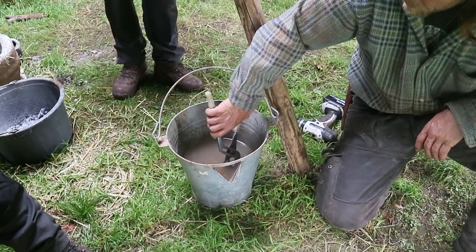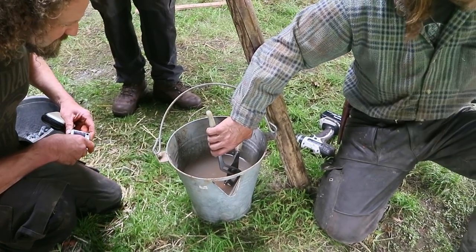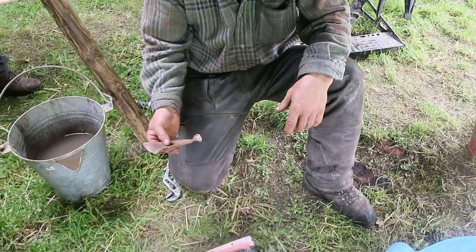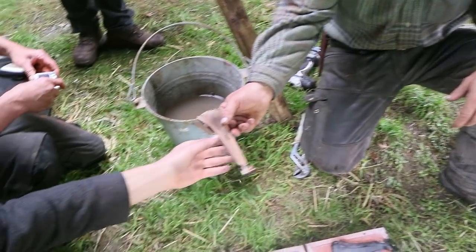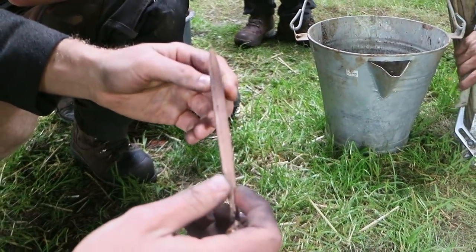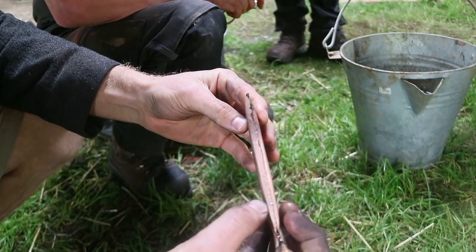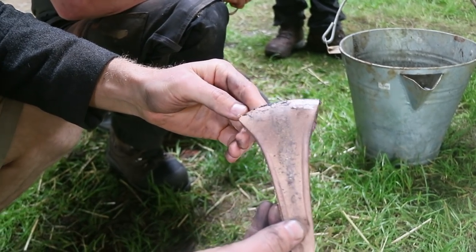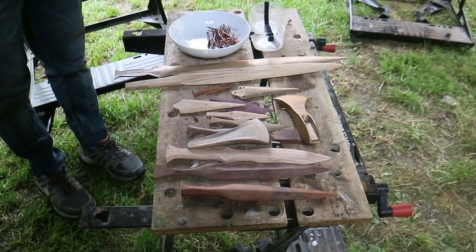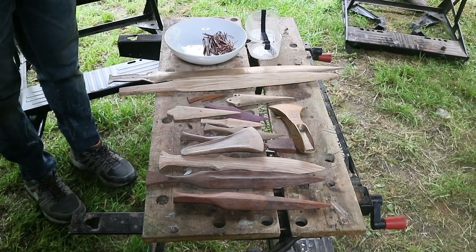Just enough water in there. I'll fill it right up in a minute — we're going to be loading up. So that's the flanged axe. Can I see that? Sure. That's nice, isn't it? It is very nice. Very very little flashing. That's the 10% tin in copper mix. Once we get some files and bits and pieces on that, that'll come up like gold. Really? Yeah. Those two are 900 grams each — you've got two kilos worth there.